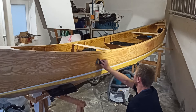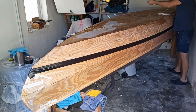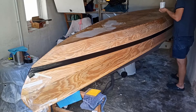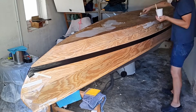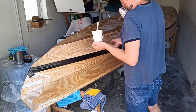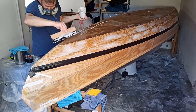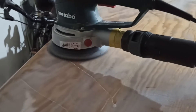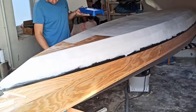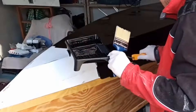It is important to pull off the tape directly after the varnishing. The area under the waterline needs to be the most resistant and flat, so I put a layer of epoxy and 20% micro balloons on top of it to reduce the unevenness. This layer was then ground down with 180 grit. The next step was to apply two layers of epoxy light primer wet on wet. As the hull was still not smooth enough, I waited until the primer had cured completely and sanded it again with 180 grit by hand.